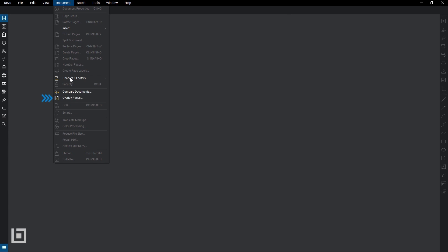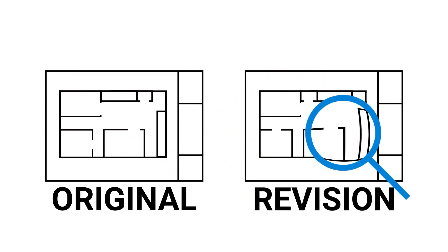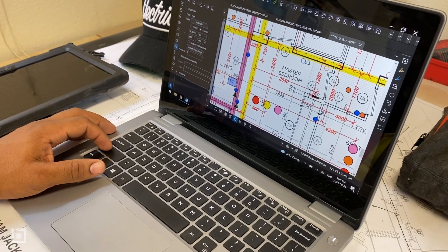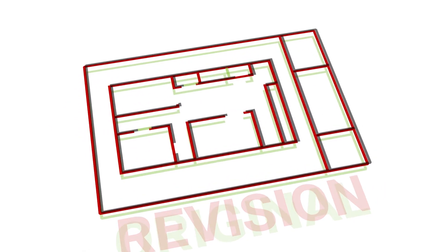Overlay. The fastest way to figure out if your drawings are lining up is with the overlay tool. So when you're roughing in units and doing high-rise slab, you have to figure out which walls you're able to run your conduit up that line up with the wall above. Within the overlay tool, I will grab the third floor drawings, overlay over the second floor drawings, and figure out which concrete walls line up with which.